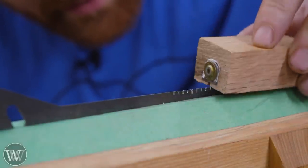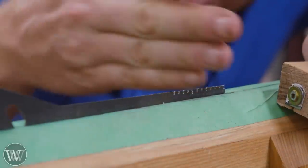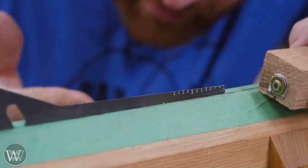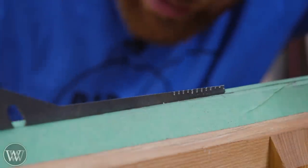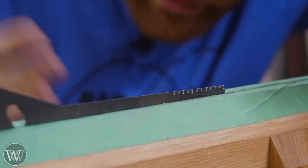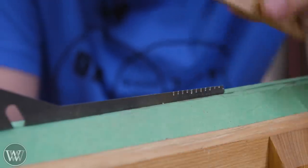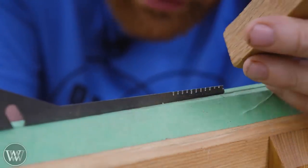With just the screw heads alone, I can change the sizing from around 13 PPI all the way up to something around a 7 — which covers a lot of the saw teeth you're going to be cutting. If you want something bigger like a 4 or 5, just put a couple washers behind it and figure out the total thickness of that stack — that's the spacing between your teeth. The one big downside is there isn't a depth stop, so consistency depends on your stroke count, but it works out pretty well. And it is incredibly fast — far faster than the C-clamp separating jig.